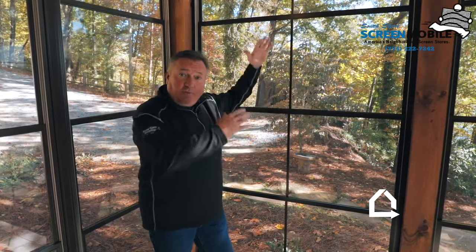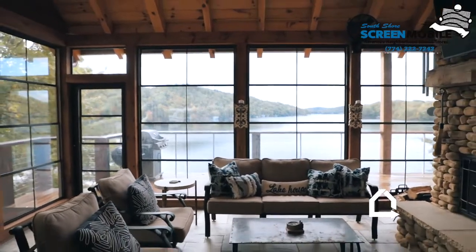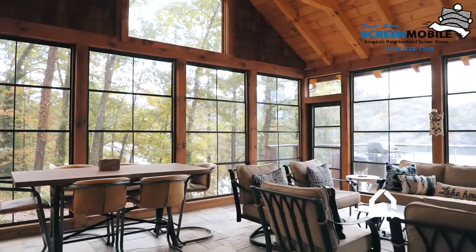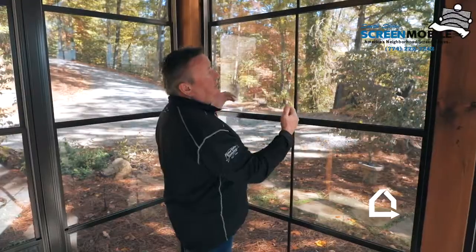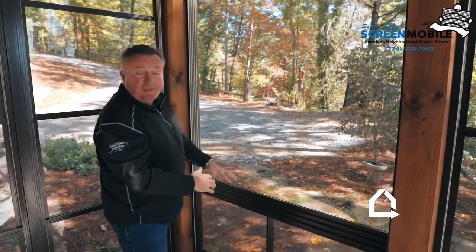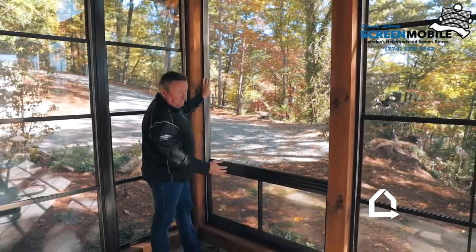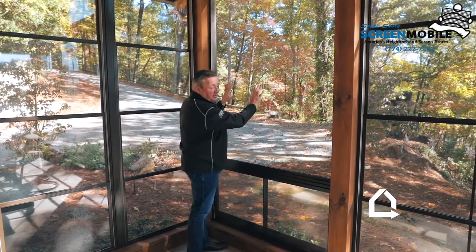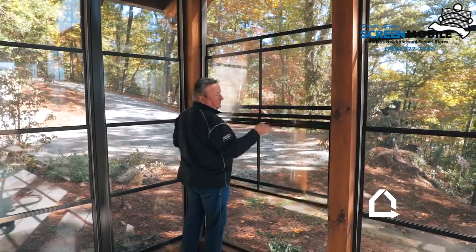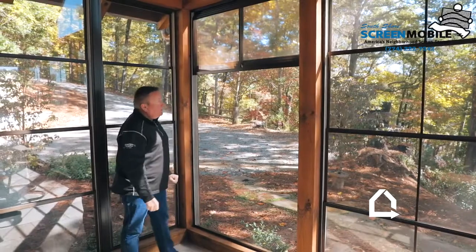This product does have a full screen on the outside of it, but on the inside we have a stacking window system. This product is used to replace a screen system. The vinyl acts as an insulator so it keeps the rain off you, and the beauty of this system is you can also use it as a screen room. Just by pulling the tracks down, you can open and close the window to give you up to 75% ventilation. These sashes stack on each other and move up and down through a track system, opening and closing to expose the screens. By lifting the sashes up, you can open and close them from the bottom to the top or the top to the bottom.